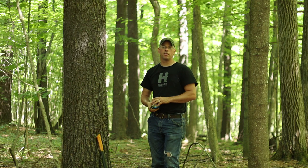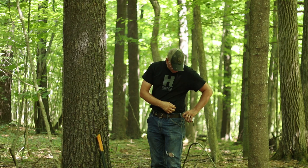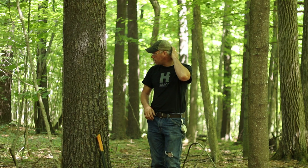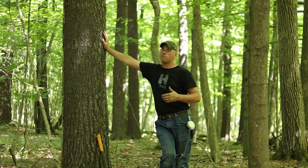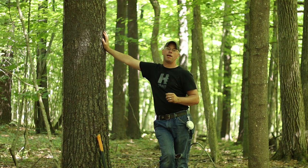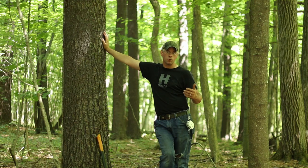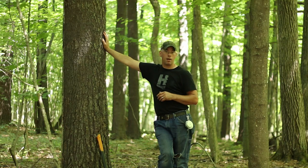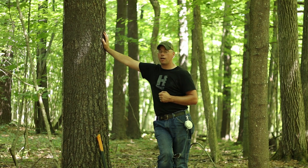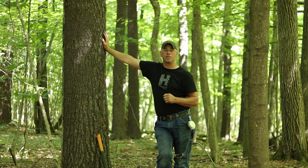There's nothing more beautiful than a nice white oak frame. Just beautiful. I'd like to build one myself. But as far as stability, I really like the white pine. Of course, if you're using white pine, your timbers end up having to be a little bit bigger than they would, say, if it was hemlock or white oak, the two other really big woods of choice. If you have access to Douglas fir, by all means, I would pick it over any of them. Douglas fir is the most stable species of tree in North America. White pine is number two.